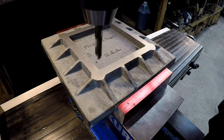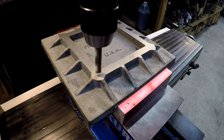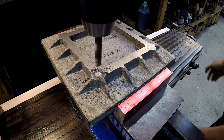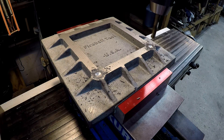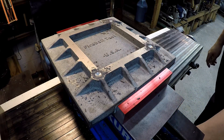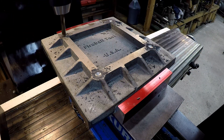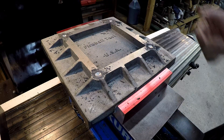I'm going to go ahead and spot in the four hole locations first, and then we'll do the reamed holes for the pins last. We're on our three-by-three for our first location. There are our four spots — now we'll go ahead and get them drilled and tapped.